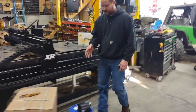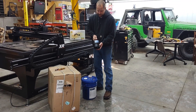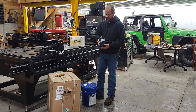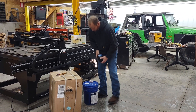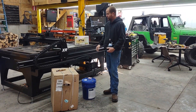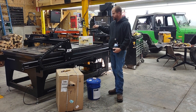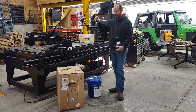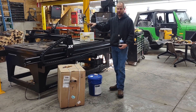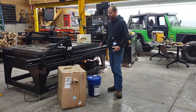There are some other things I ordered. This is the Motor Guard filter — trying to keep your air dry. I'm going to install this within about a couple inches, maybe a foot, from the actual plasma cutter itself. And then we have the Sterling Cool — I'm going to start utilizing that as well. I'm going to drain the table, install four larger drains, one in each pan. It's actually going to get pumped out into a 275-gallon tote, and then I'll pressurize that tote with air and it'll refill the table.